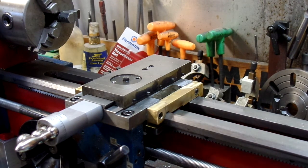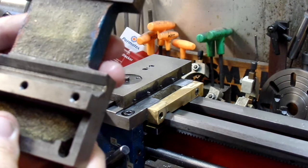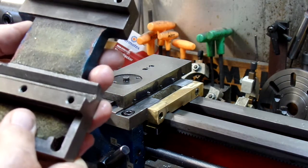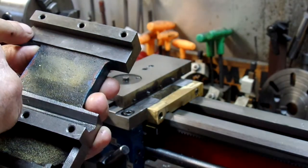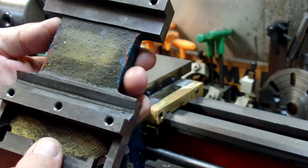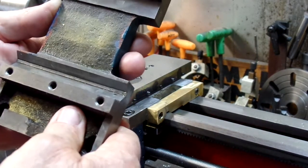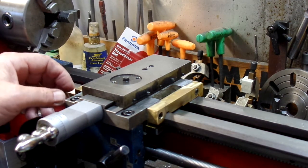As you can see I've been busy. This is my original cross slide. Since it's made out of a rather poor grade of cast iron, and I think the basic design has some shortcomings. If you examine the wear patterns on your carriage you'll see how each side is worn off. The original machining — I don't know if that shows — is still present in the center. I didn't really use this that much, but you can see the poor grade of it.